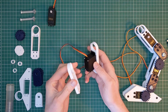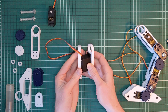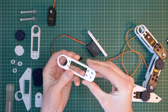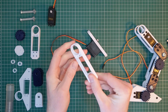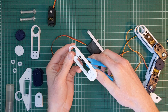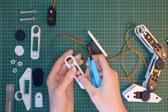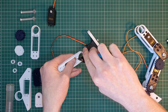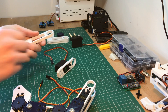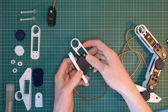This side is a little bit more complicated. You can see there's an output for the wires, and normally that wouldn't fit because there's actually some 3D printed material in the way. I've printed this so that there's a tiny sliver there so that when it's used for the top it looks like a solid piece, but underneath there's actually a decent amount of space. So I'm going to take a pair of snips and cut that out so we can pass the wiring through in order to close everything off. Once I've done that there should be a gap for the wiring so I can feed that through and with a little bit of wiggling get that attached in the right way.